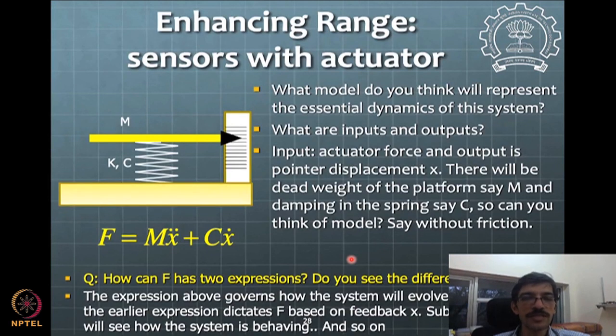When you analyze how this control would work, or how it will settle the system, you need to substitute this value of force, as you are proposing as a control, into the expression of dynamics, and then do the analysis. Then you'll be able to find out how this proportional feedback is going to affect the state x of the system. Or you can convert this state x into the error dynamics and study what will happen to the error: how will it go to zero, will it go to zero instantaneously, will it oscillate, and how can I control the settling time of those oscillations. All those things one can talk about in a lot more detail.